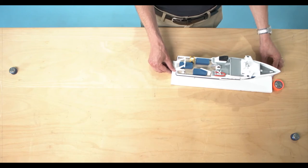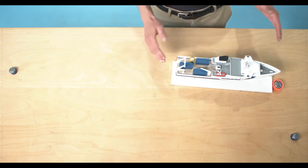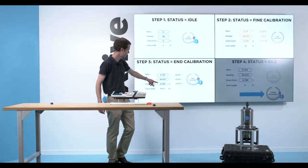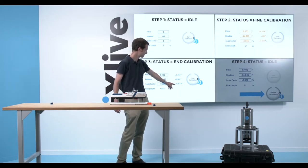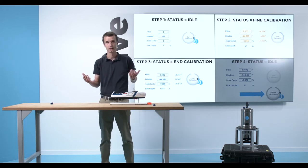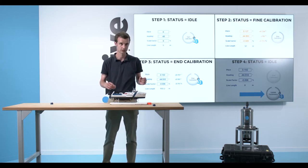When they turn blue, that's when I reach this virtual point, but my real trajectory is not the measured one. The measured one is actually here. And that's how I'm able to compute angular value, scale factor value, and of course pitch error value. Here, because I went under the criteria I gave you earlier, everything is turning blue, so that's when I know to stop the calibration. Actually, I could continue to do this calibration, and even if I stop calibration or continue, the values will refresh and get better in the algorithm.